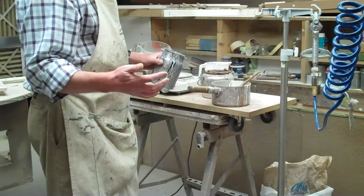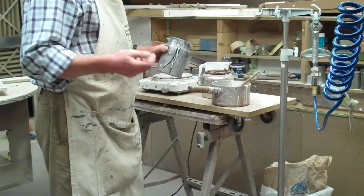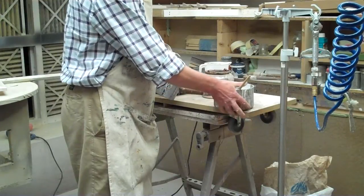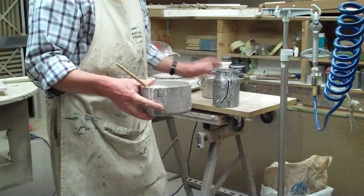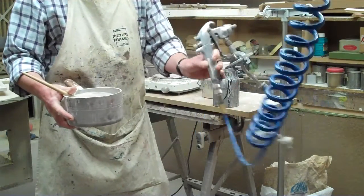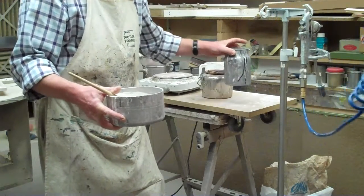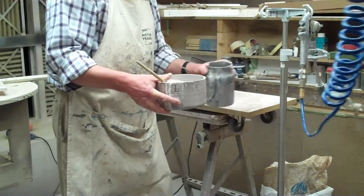Just a word about some of the possibilities — you can actually spray, and it's a brilliant technique if you've got the facility to do so. For that I use one of these old De Vilbiss JGA suction guns, and the reason I use that is it's got a metal pot, so if I'm working over a period I can stand it in some warm water to keep everything nice and warm.